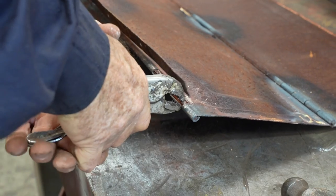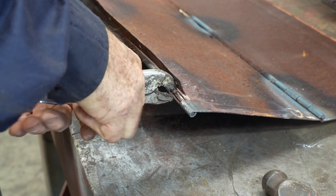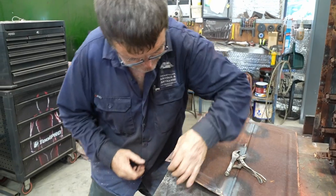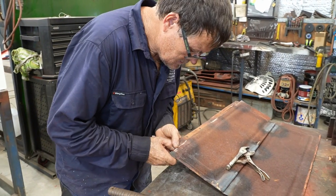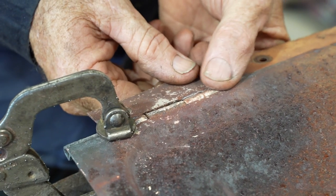Welding thin sheet metal is tricky. If the welder is set too hot or the wire is too thick, then it can actually burn holes in the material. It's important to have everything set correctly and to start with small tacks so as not to overheat the metal too much. Daryl is a carpenter by trade, but has a lot of other skills. Lately, he's been taking on a lot of welding wisdom from Jesse.